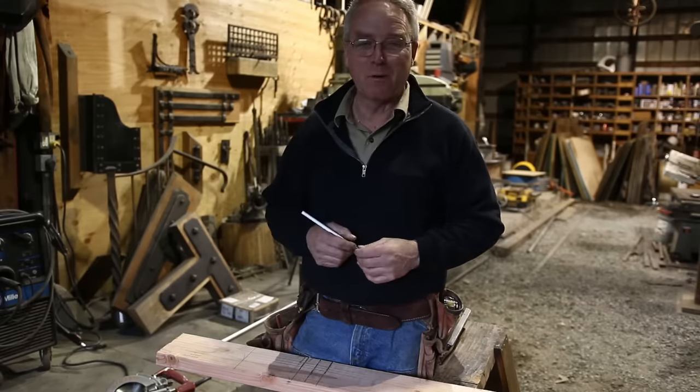The most technically accurate line that you can make, maybe you're doing finish work, maybe you're building a piece of furniture. I have here a piece of vertical grain white oak. It's been stained, it's been sealed. Got here a piece of clear vertical grain fir. I'm not just going to pull out my big pencil, and I'm not going to hack this with a skill saw. You can put your scribe on there and take your utility knife. That's a fine line. That's the kind of tolerance you need when you're really working down to a tight, tight specification. A razor knife, a box knife, a nice sharp edge is going to give you a line that's accurate.